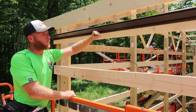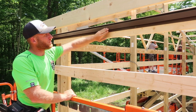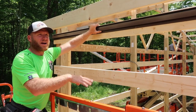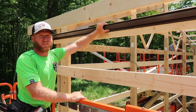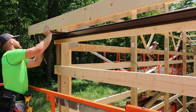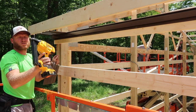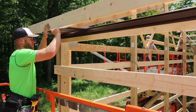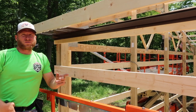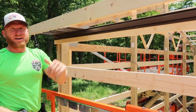When laying out the building with our story pole, that top soffit nailer we put on the post exactly so that when we put our trim here, this soffit F and J - the top planes in with that 2x6 and that is in plane with our fascia board. By doing that on the ground we don't have to come up here and get it all figured out and snap lines because we've already done that work. We're using a metal soffit, perforated on the eaves. I like to use the brushless DeWalt stapler - it works pretty well. I always like to staple right in the middle of each piece so I know where my staple is when I go to put my fascia on and put a fastener through - I know where not to screw.